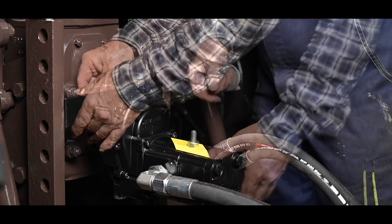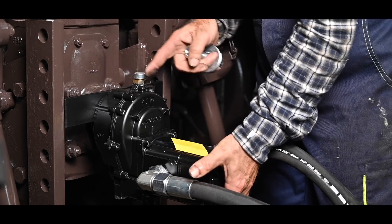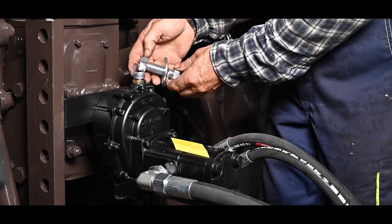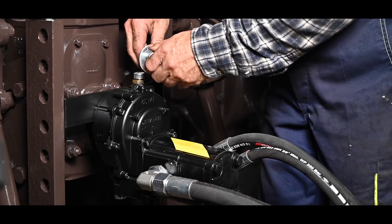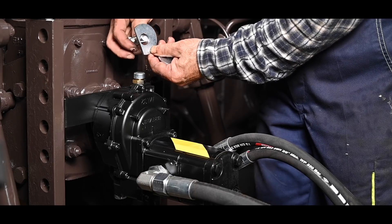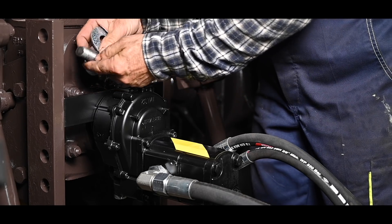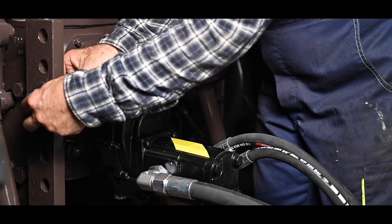Here is the final bracket, now going to be bolted on to hold the oil pump nicely in place. I don't want this pump to hang down on the PTO because it causes more wear on the PTO bearing — that's why I made a stronger bracket. I can now position it properly by lifting up the pump and centering it. I'm using big bolts through the sides — I cut the washers a bit on the side where they go in — big washers, put the nut up, and tighten it all up.